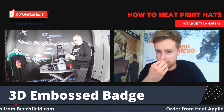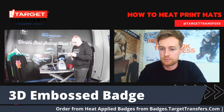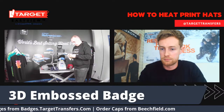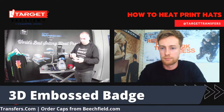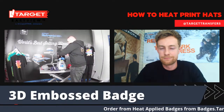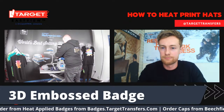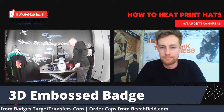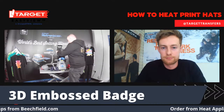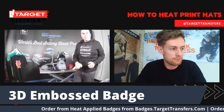To do this, all you need to do is pull the backer off. You can see the metallic finish on the back. We've got the plastic carrier on it. Keep yourself enough room for the decoration. We're actually going to go over the seam with this one, and this is one of the real game changers with this new press — you can decorate over the seam, which was unheard of until a couple of months ago when Hotronix brought this press out. Go with the thinnest foam pad, put it down for 45 seconds, and then it'll be done.